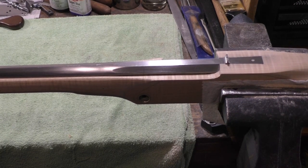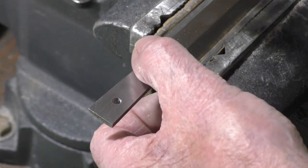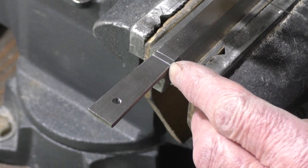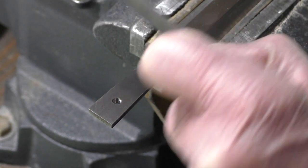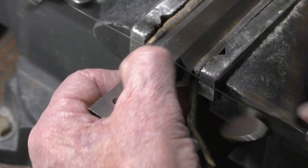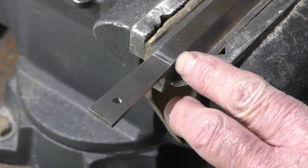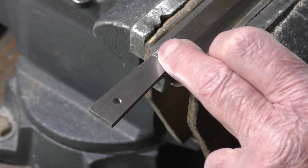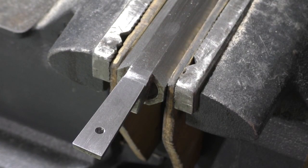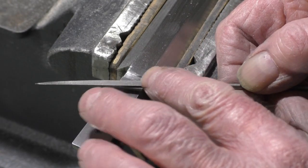So I'm going to cut a dovetail into that tang right there. I'm going to start off with two slots to about the thickness of this blade — about 40 thousandths — and I'm about five thirty-seconds back, and about a little over an eighth wide. Big enough to get my file on edge in there, and I'm going to make a series of slots to start with to take this chunk out. I'll go across here a few times and then start filing that down to get a notch in there between 40 and 50 thousandths. I've got my little three-cornered triangular file here — one edge has all the teeth ground off of it, that's my safe edge. I'm going to use that down on the bottom here and start going forward and back with this 60-degree angle — same as what the dovetail is. This dovetail is 60 degrees, the file is 60 degrees.